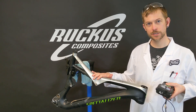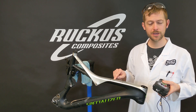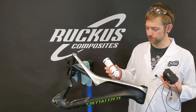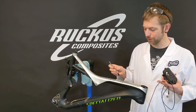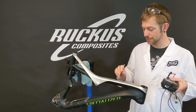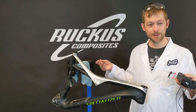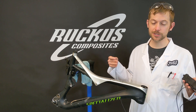Welcome back. We wanted to take the same specialized mountain bike that has the obvious top tube damage we already talked about in our previous quarter test video, and we showed you what the damage really looked like. Now I want to show you what ultrasound looks like and why we do it. It's a little more complex, it needs a little more advanced user. But in general, how you do it is just like at a hospital — you apply your ultrasound gel or jelly. That's a couplant, and it helps evacuate any air between your object and your transducer. The transducer is the little device that puts out the signal and receives the signal for your screen for analysis. We perform ultrasounds on almost all repairs and bikes that come through, and the reason is it gives us the damage size, the damage extent, and an accurate thickness measurement of that area so it tells our repair technicians how much to put in, or how much to take out, and how much to put back in.